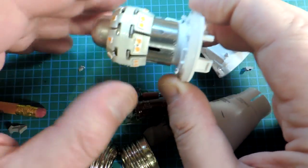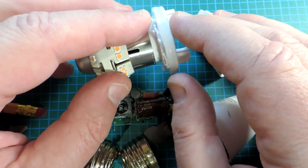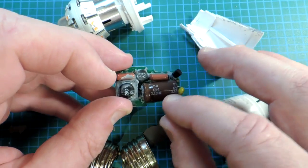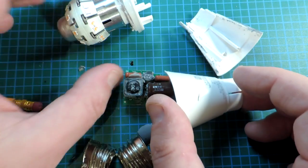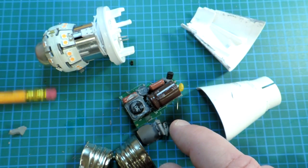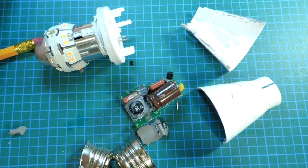Switch Infinia — clearly they've got the liquid cooling around the LEDs, which gives some credence that this part of the design will have a much longer service life than some competitors. They've had to resort to an electrolytic capacitor on their power supply, and I think that'll be one of the weak points on the design. Even though they've thermally isolated it, if it does get too hot it will not achieve that 25,000-hour service life desired — or support that unlimited residential warranty.